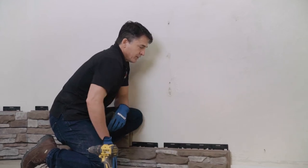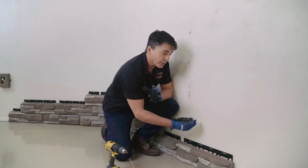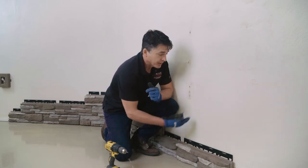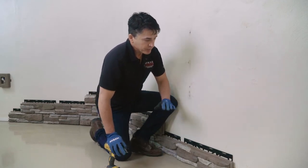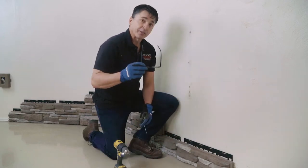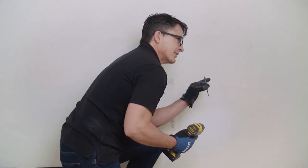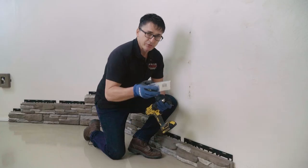All we need to do is take a masonry bit, drill right through the hole and into the concrete wall, and install a concrete anchor. If you were going over drywall and needed to hit a stud, you could pick a hole that actually hits the stud behind the interior wall. Put on eye protection and install the first concrete anchor. We'll change out to a 5/32-inch masonry bit — these concrete anchors will tell you what size drill bit you need, and most of them come with a drill bit.